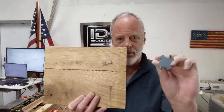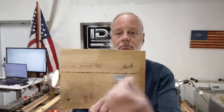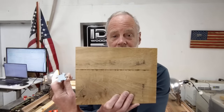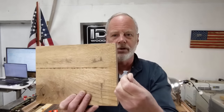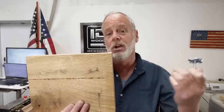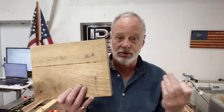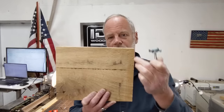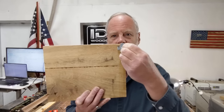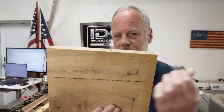To summarize the setup: we have 10 inches wide, plus 1.5 inches on the left side, plus 1.5 inches on the right side, plus a little extra on each side — so we'll go about 2 inches on each side making it 14 inches wide. The board is 8 inches tall and we'll add half an inch to each side making it 9 inches, so the bit starts its cut right where we want it. Let's get into the Vectric software and design this up — it's very quick and simple.